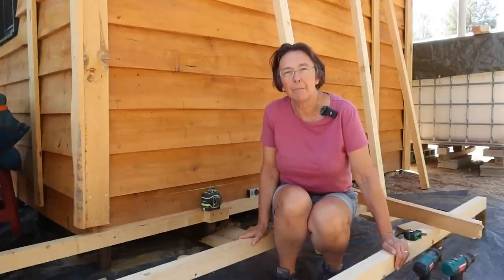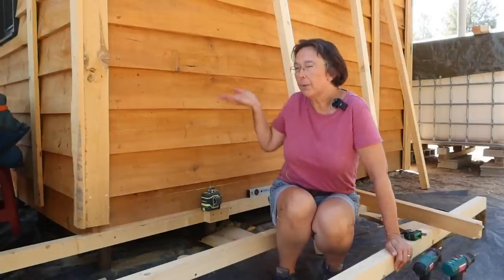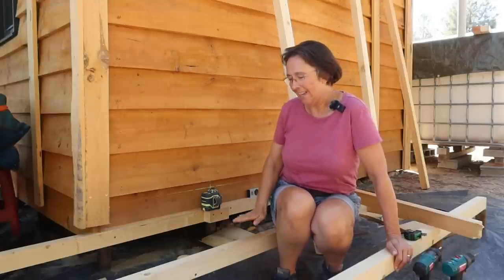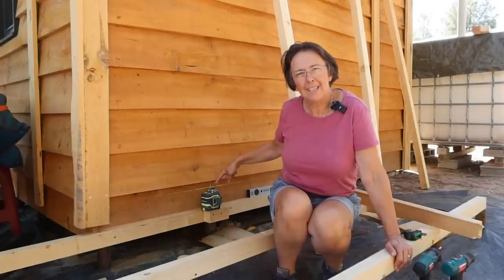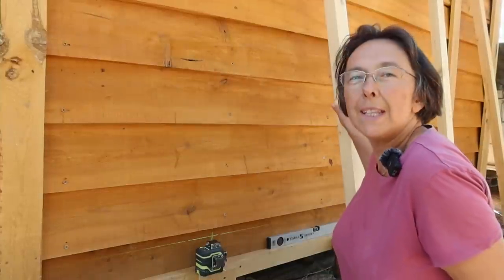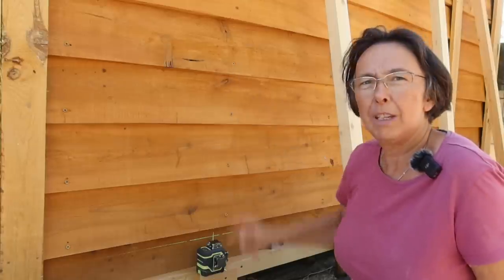That's all of our base frame in place. It's good and solid and ready for the deck boards — we don't have those yet. What we're ready to do is build up the structure for our shower and toilet, and to help us get the uprights upright and the levels level we've been using this — a laser level from Lasgoo, and they're sponsoring this video. Thanks very much Lasgoo. We have our uprights cut to the correct length and now we're going to use the laser level to get a true vertical so that we know it's going to be straight.